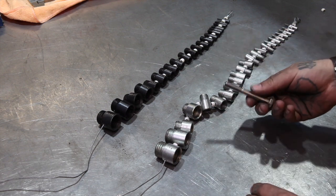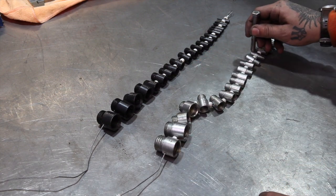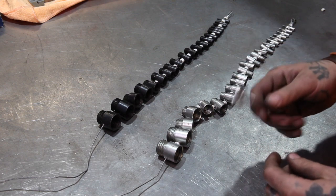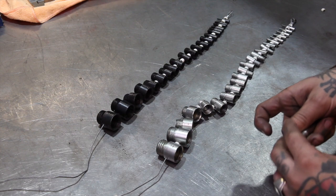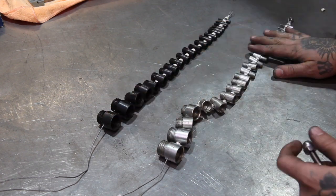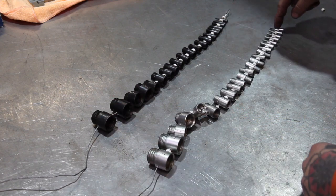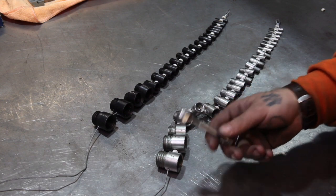Awesome for old Harley stuff again, because they have some really weird and wacky combinations. Sometimes you'll think by measuring it out that it's a 3/8 UNC or some sort of standard, and it is absolutely not. They use unified special threads quite a bit, and that's just not something you can run and get off the shelf, especially in Australia. The metric version goes from M3 up to M24, which is pretty wild. The imperial version goes from a number six all the way up to an inch in both fine and coarse pitches.